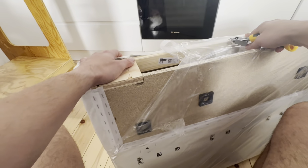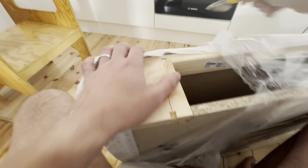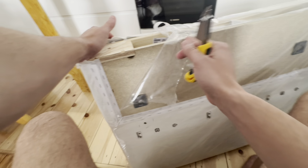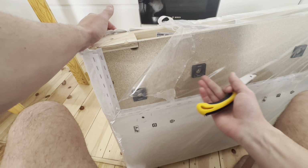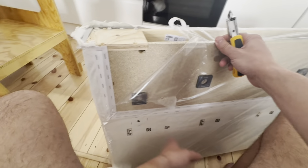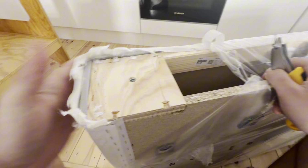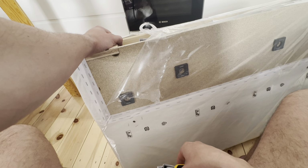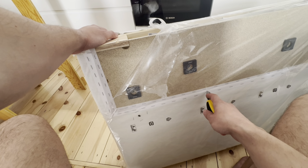Same for the top, but it's important that we don't just cut this off, you know, with a blade all the way around, because once the actual wood is cut down, you just want to have that excess so you can wrap it around and restaple it properly, so at least you're getting proper coverage. If you cut it and then all of a sudden you've cut too much material and it's not enough to cover the end, that will not be pretty or professional. And even though this is DIY, we always aim to do things better than the company. So I'll crack on with doing the rest of that, and then I will pick up on the next bit.